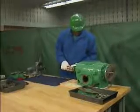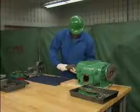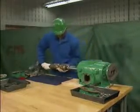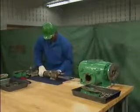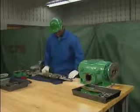First, he pulls the rotors out of the casing together. Second, he holds the rotors firmly together as they slide out of the casing to keep them from shifting. And third, he makes sure that the rotors are adequately supported until he sets them down.